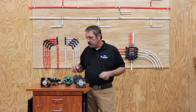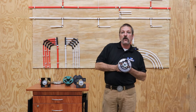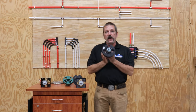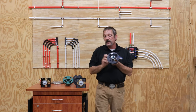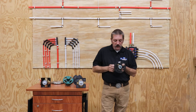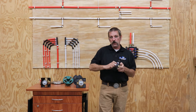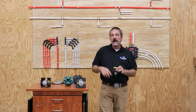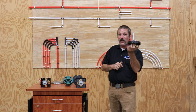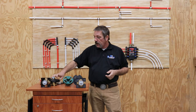The other popular one we use is the Peerless valve. Peerless is a sister company to Delta. This is more of a builder-grade valve — it's a little cheaper — but it comes all made together and ready to go. If you're going to be sweating it, you'll want to take the cartridge out first because you don't want to get the valve body hot and melt something inside. I've been on a couple service calls where that happened and they had solder all up in the valve and it wouldn't turn on.